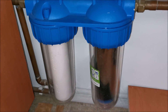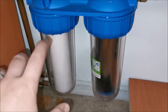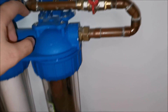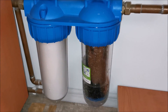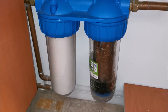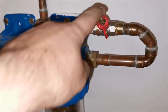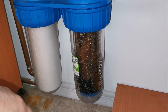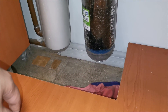Both new filters are in place. Now I'll give them water slowly and then from the inlet valve I'll gradually allow water into the house. Opening slowly — just a little bit — and the water should fill in as everything starts to pressurize. Make sure you are not dripping anything.